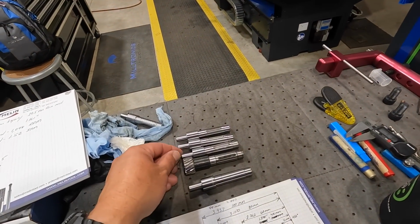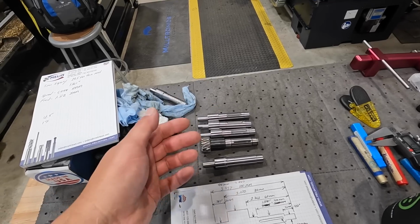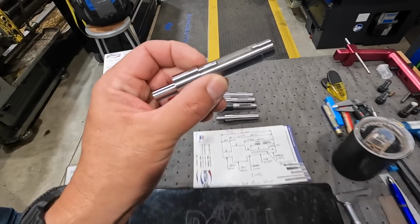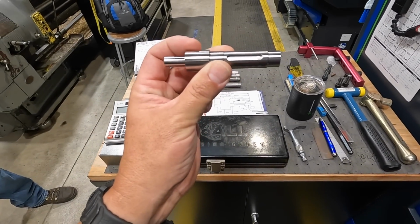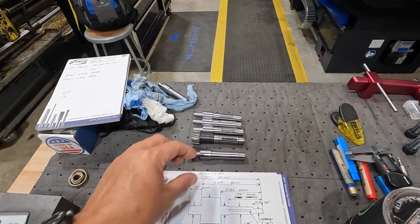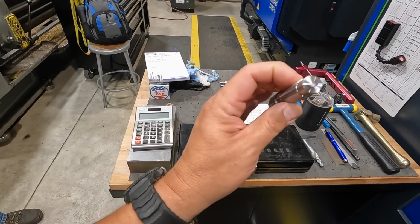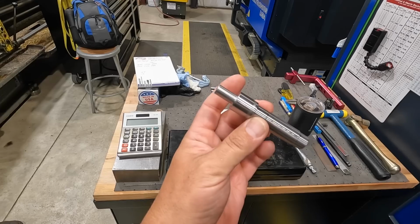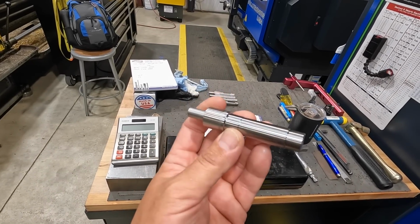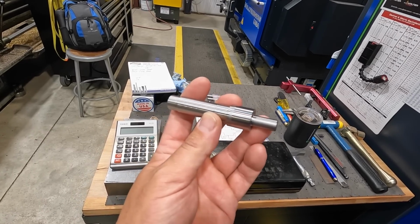And we've used our sample shafts here that were not exactly on size, but they're good test pieces. So we've already got 3 of them cut with our 5mm by 30mm long keyway in there, and we've finally got it to the size that we want it. We're gonna go ahead and do one more. So this guy right here, I marked it with the X on the end. This is a good part as far as being on size and all of our shoulder lengths being correct. It was just kind of an ugly part because of the finish on that.